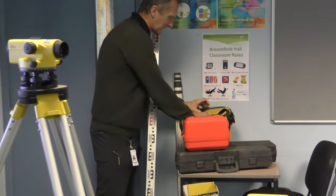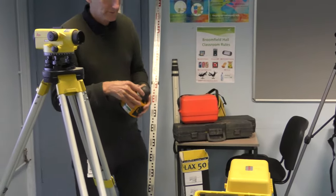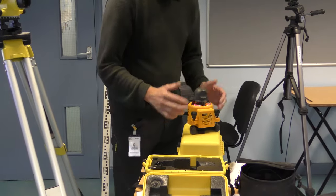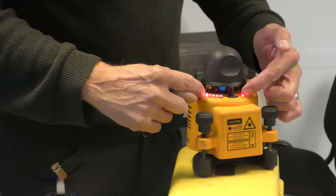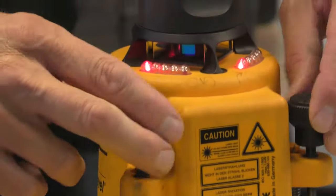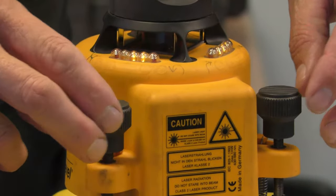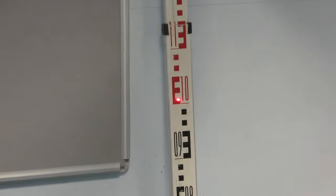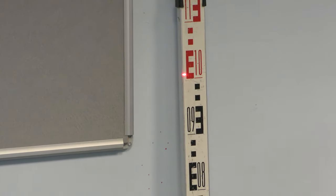To test you on this, I'm going to use a laser level and shine it onto the staff. The laser is also placed on a tripod. You can see it's spinning around slightly. This one has little indicator marks — the red shows which direction to turn each footscrew. When both indicators change to amber, the laser is level.